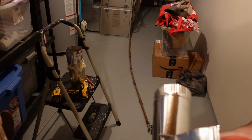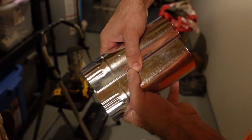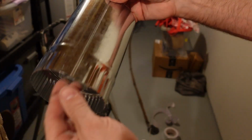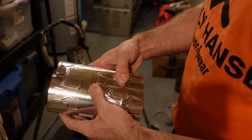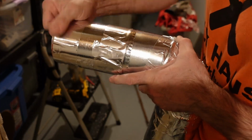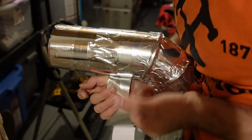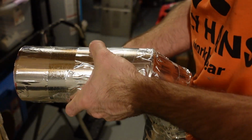And then to assemble the duct, you just sort of clip the two ends together. Not too difficult. And then once the duct is put together, again, just take some of that high temperature metal tape and then seal up all the joints, and then obviously install it into the 90-degree elbow. And then I'll take that high temperature metal tape again and seal it up as well. So overall, pretty easy to do. If you don't have an old one to go off of, obviously you're going to have to get the tape measure out and take some of your measurements yourself.